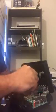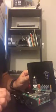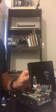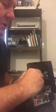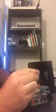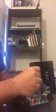So I'm just going to grab this tube. Again, I know this sounds ridiculous. Make sure this thing is not plugged in. Even on some stuff that uses power tubes, even after it's unplugged, it's still not safe to work on because it still has power on the capacitors. So that's just a little disclaimer there. Don't work on anything electronic while it's plugged in.